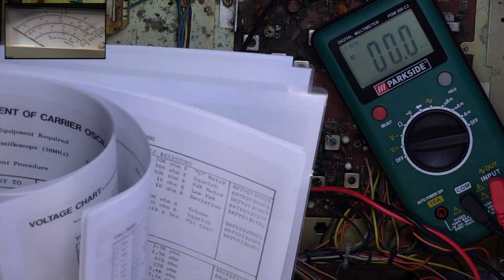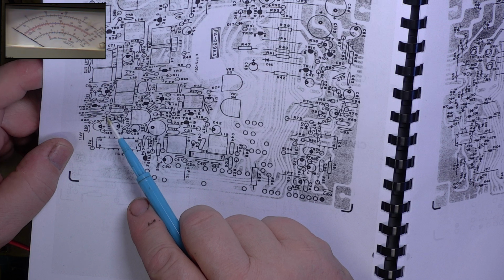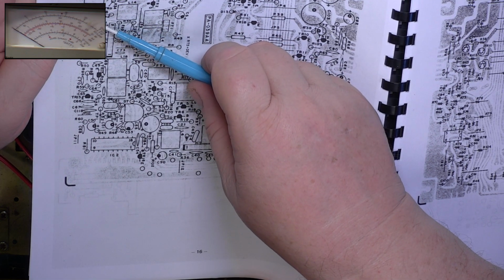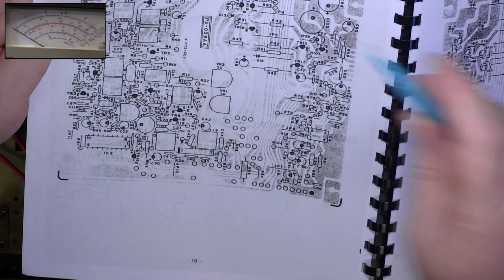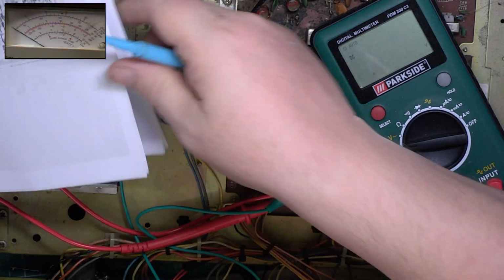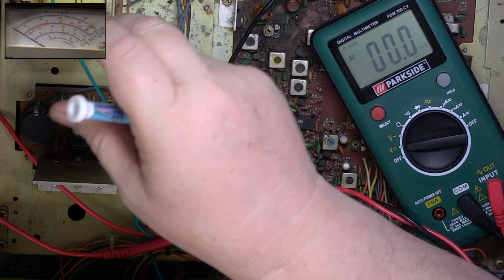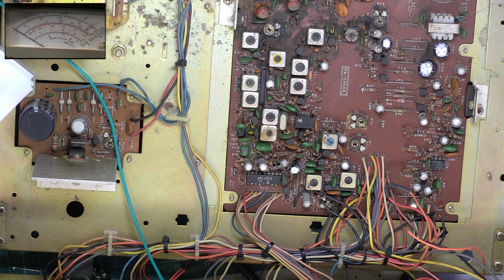So let's go looking for test point 3. So test point 1, resistor 52. Test point 2. Test point 3, resistor 6, by the looks of it. Which is there. Let's see how many of these I don't see. Right, we'll get the oscilloscope out. Again, I'll use the portable one because I don't want to change the two which are on the instrument stack.